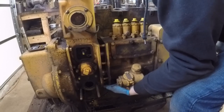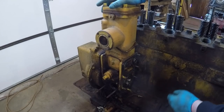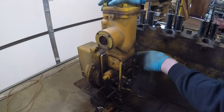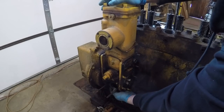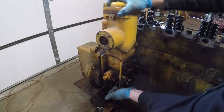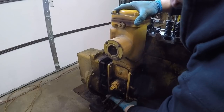Fuel filter tower now is a little bit more straightforward. These three studs that had the hidden nuts behind the injection pump just pass through holes in this side of the flange, so you just have four fasteners up here that need to be undone, and then just work it off its alignment dowels and guide it off the studs.